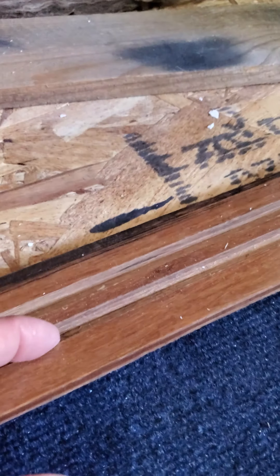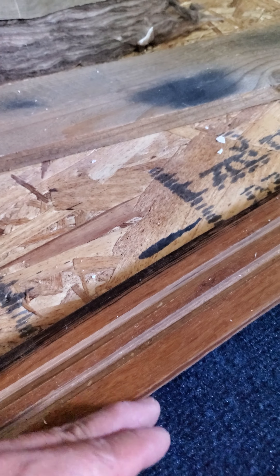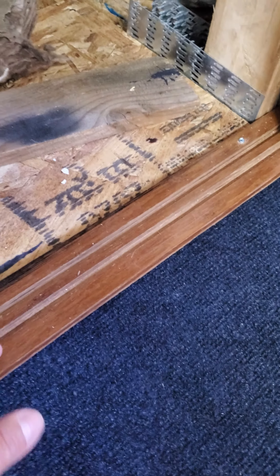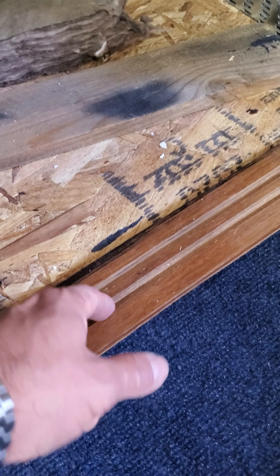I have some extra shingles and things that I'm saving. What I had to do is I almost had to do three cuts on my table saw for each of these tracks. I did an inch measurement on my saw, did one cut, then flipped it — did the other side one inch. I did all the woods at one time, then I'd remove the blade, cut that, bring the wood back in, move it in like a quarter inch or less, do another cut, then do the third cut.